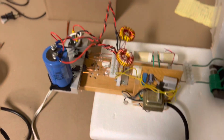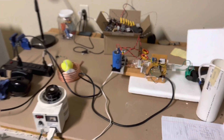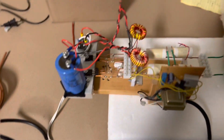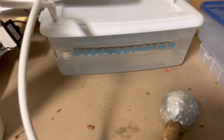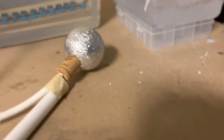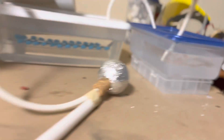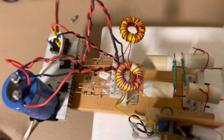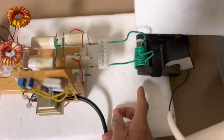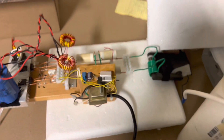Welcome back Youtubers. Just cleared up my messy desk and that's about as clean as it's been for a long time. I wanted to pull this thing out and mod it — which is basically a voltage multiplier with 12 stages in oil, a string of resistors 120k total in oil, and a ZVS driver here which I tuned to get this flyback, which is an AC flyback transformer, resonant.